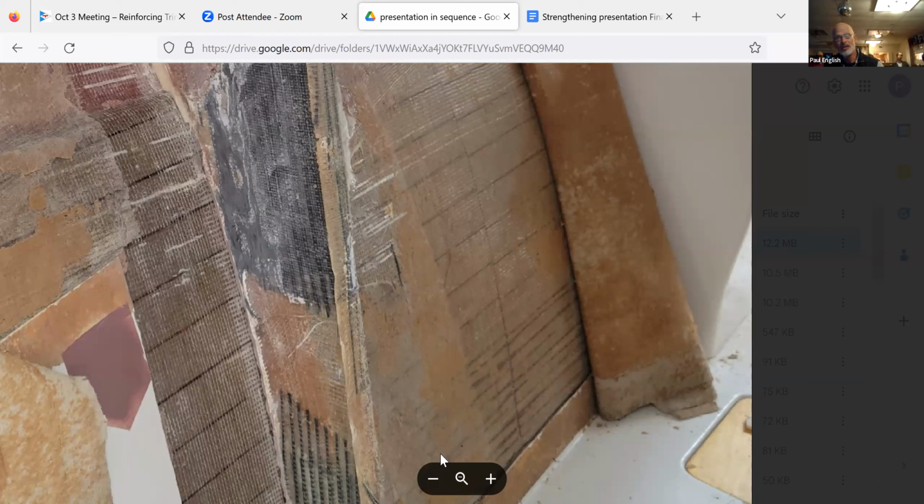In doing the excavation, it's very interesting what he found. About half of the tabbing in this area had actually cracked right at the 90 degree angle. So the tabbing itself didn't delaminate, the tabbing itself broke. The rest of it did in fact just pull off. He was able to hand detach it; he didn't have to grind it off. He said the tabbing appeared to be a single layer of 1708 fabric, which is a 17 ounce biax with a little bit of mat on the back.